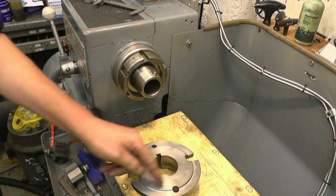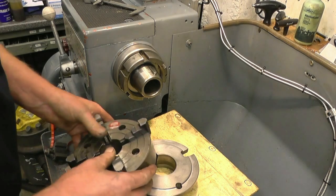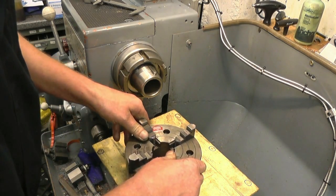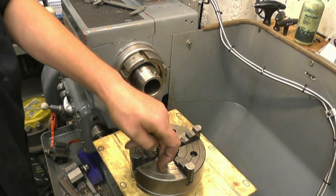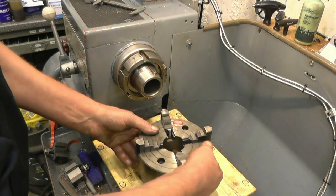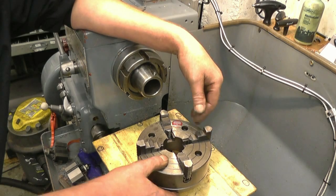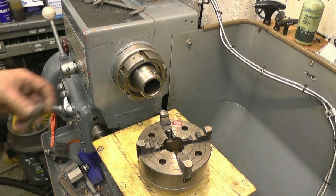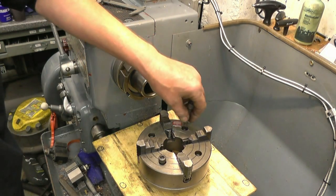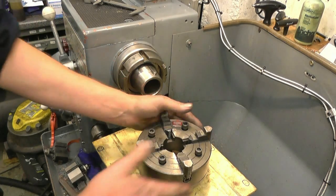There's 4 places there where the bolts can go, which are in the middle of nowhere, so to speak. I'll go on there like that. Mount on the milling machine, I'll spot through, drill and tap them. I'm not sure if it's Whitworth or UNC, I'll have to have a look at all these original bolts. They look like UNC. Right, very pleased with that.